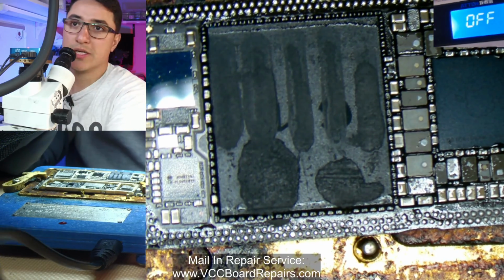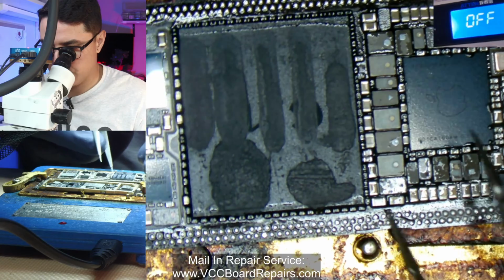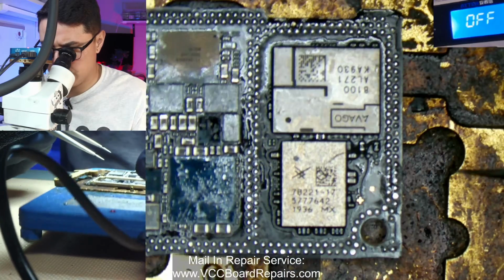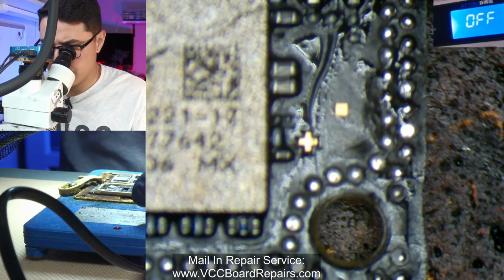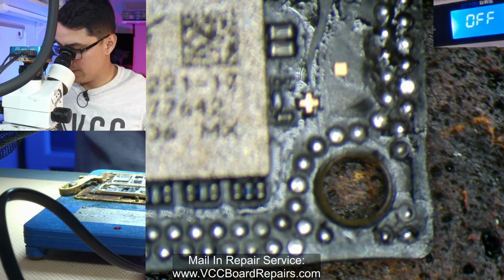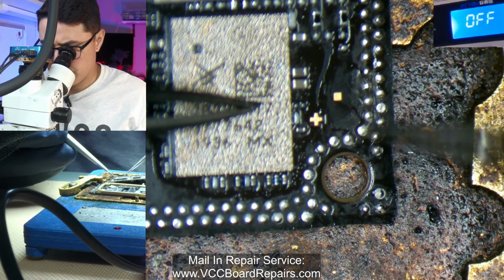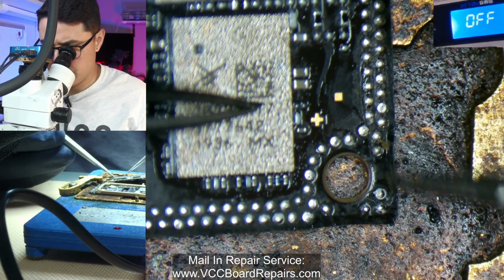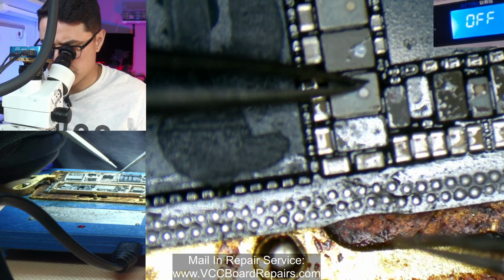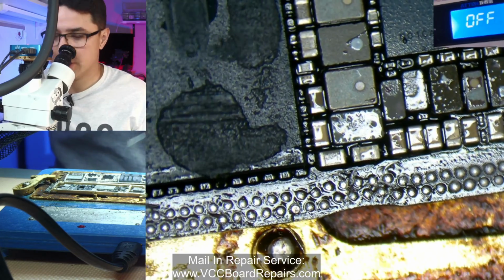All right, so now I'm going to turn on the board heater. I'm going to clear out some of this thermal paste that got onto the board. Check all the pads, make sure there's nothing dirty, no random debris, like dog hairs in my case. This looks a little weird. I'm just going to scrape it off with my tweezers. Oops, out of focus.